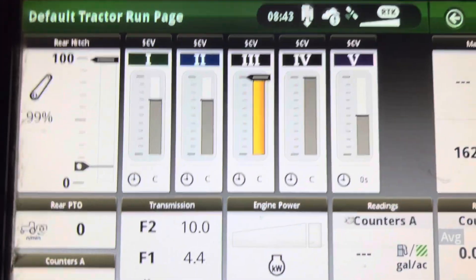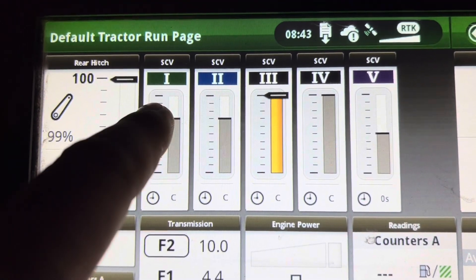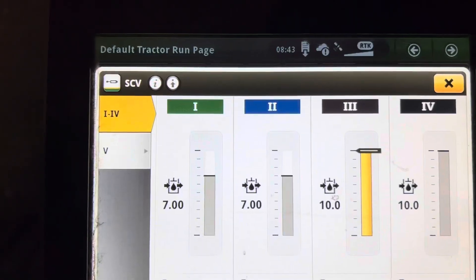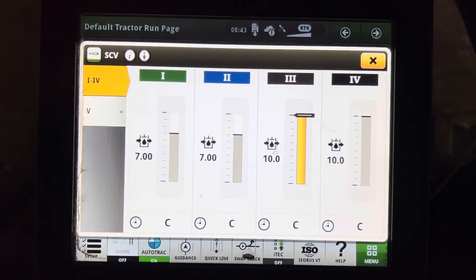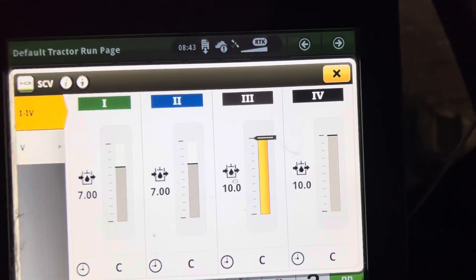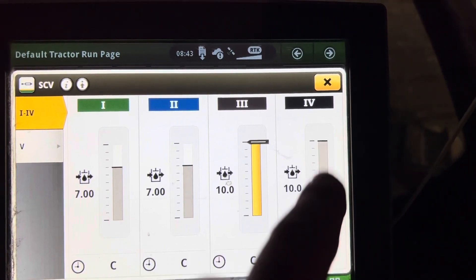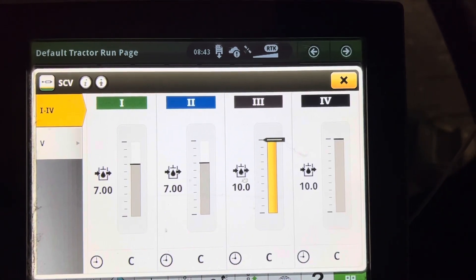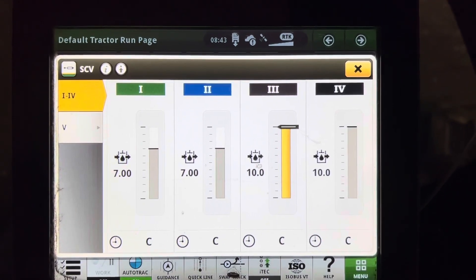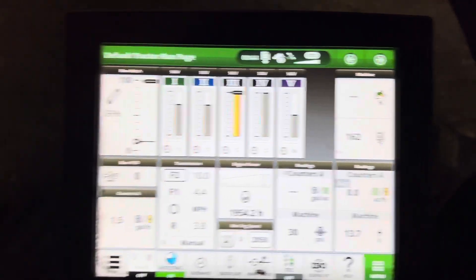So we'll get out of the GPS. My first hydraulic — that's the boom chain — I have it set on seven. Let's open up the hydraulic tab. The first hydraulic, boom chains, is on seven. Second hydraulic is the multi-step table, it's on seven. Third hydraulic controls all the machine controls, it's all the way up on ten. The fourth hydraulic is just shakers; I usually go between six and eight, but I have it on ten just to get rid of some dirt.